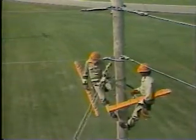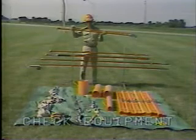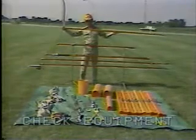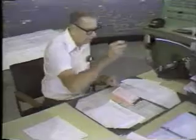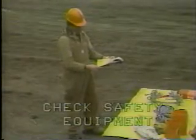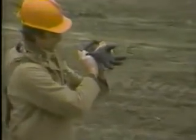The safety procedures followed are as follows. The various pieces of equipment, tools, and protective equipment to be used are all set out. All tools and equipment are cleaned and checked before the job begins. Hotline tools are never placed on the bare ground. A hold-off is obtained on the line to ensure that the line will be locked out after an automatic protection operation. The linemen give their rubber gloves and rubber glove protectors a thorough inspection for wear, cuts, or contamination on both outside and inside surfaces. Rings, wrist watches, and identification bracelets are not to be worn inside rubber gloves. Some utilities require safety glasses to be worn also.